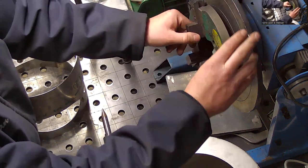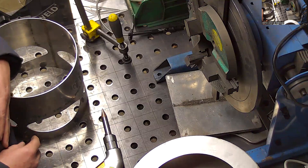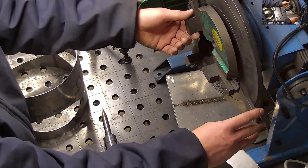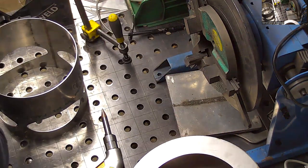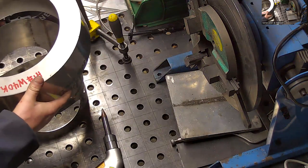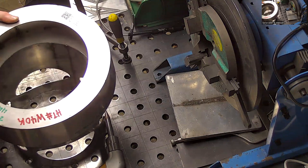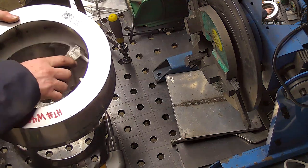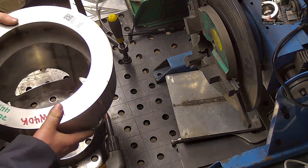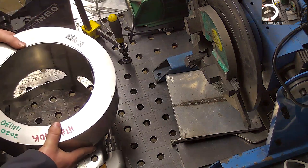So when you weld that outside corner, it won't warp on you and kind of flare out? Maybe a little bit, but not much. I usually tack it to that round piece that's got windows cut in it. I'll go ahead and fit that up and have it all together. That's a 2020. It should be 4.5 inch from bottom to top. It doesn't seem like the warping is as severe as those.